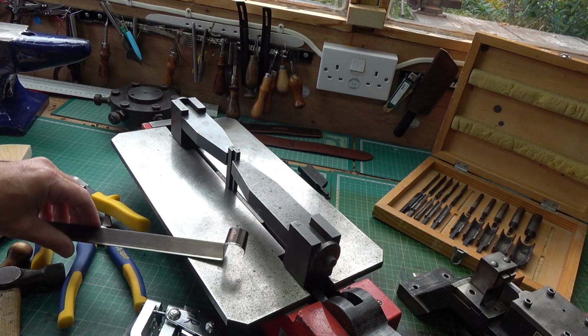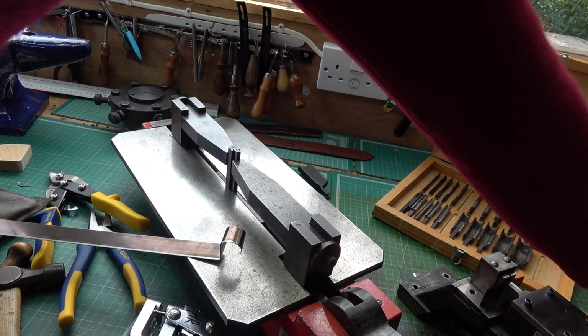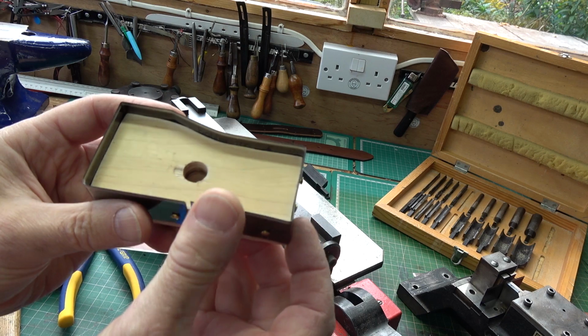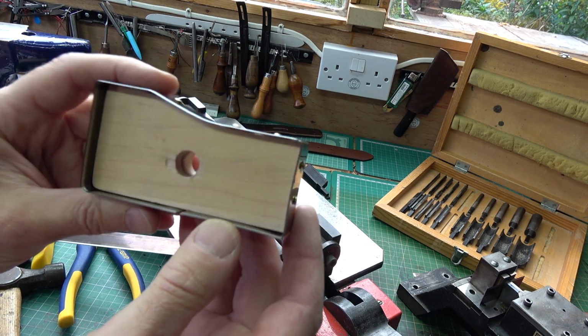I thought it would be really difficult to make that cutter. I really thought getting the metal bent around here would be nigh on impossible for me, but actually just taking my time, eyeing it up each time, it was okay. You could obviously send off computer files to a die maker to get these dies made, and to be frank, that is probably the more sensible thing to do in many ways. I, being me, just wanted to take the hard route and try and learn how to do them myself. And the beauty, if you can do them yourself, is you can make all sorts of different dies, and if you want to tweak things, you can tweak them. So you take your choice, I guess.